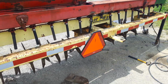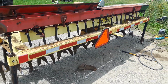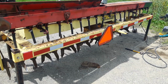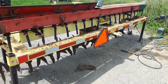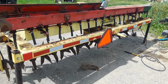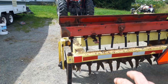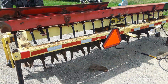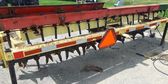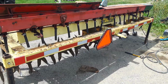My no-till works pretty decent on ordinary ground, but I have some older fields to do, and I have some people that want me to do some seeding if this works out all right on some of their hay ground or pastures or whatever. The theory behind it is, of course, the blades will cut the holes in, and I'll have the seed directed right behind. I know there are different guys that aerate and then broadcast seed, but I just figured this would probably work better as far as wasting seed. You're actually getting it right where you want it.